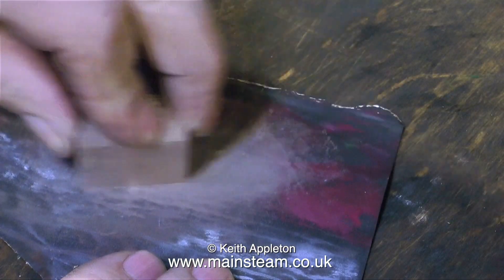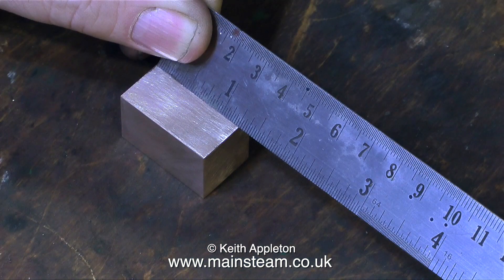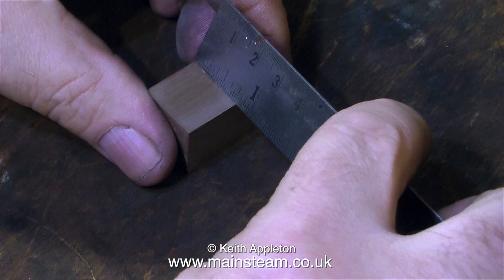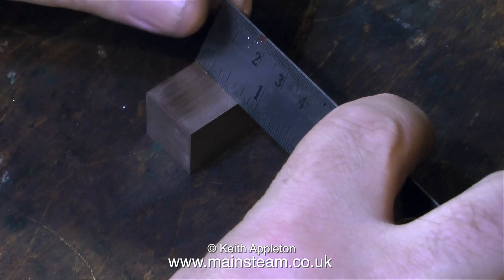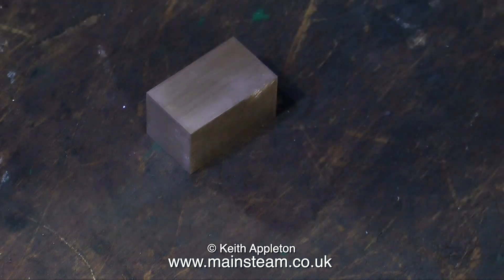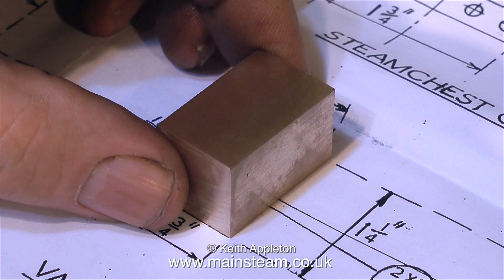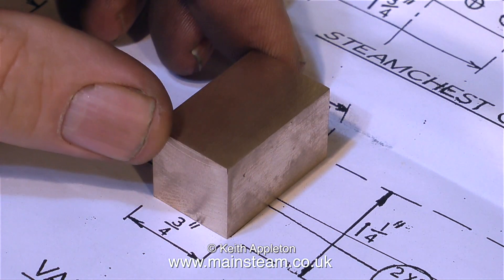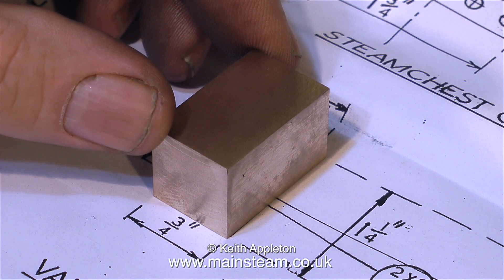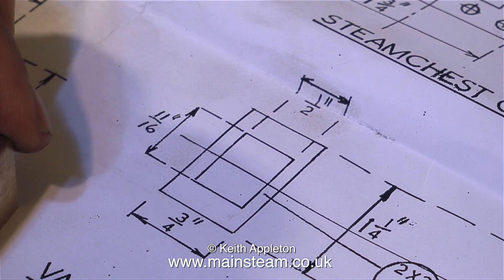Here's the finished block. I'm rubbing the block up and down on a piece of 400 grade wet-to-dry sandpaper to remove all the sharp edges. When I check the dimensions with the ruler I'm quite pleased — it's three quarters of an inch by one and a quarter inches long. Any proper engineers need to turn off immediately because what I'm doing here is laying the finished part on top of the drawing. As the drawing is one-to-one it's showing me that my piece is the right size. This has never bothered me; I've done it on most of the things I've built when I've had a one-to-one drawing.